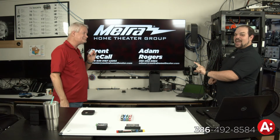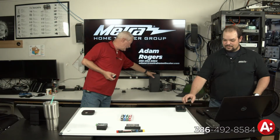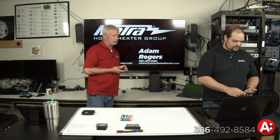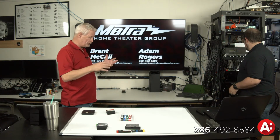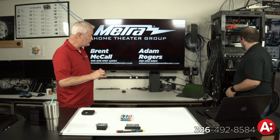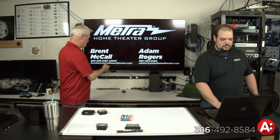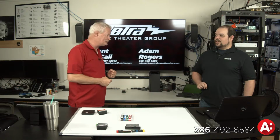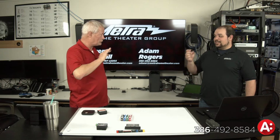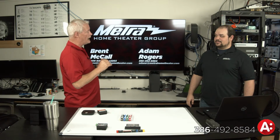Now, there are some caveats. What we wanted to find out is what happens on an Xbox Series X when you engage it. We've tried a number of our devices with it just to see what would happen. When you first turn on the Xbox Series X, 5-volt hot plug happens between your source and your display. And then there's a whole lot of EDID happening. Those lights were going crazy. And then nothing, which tells us a tremendous amount.